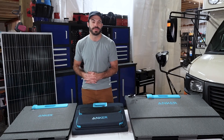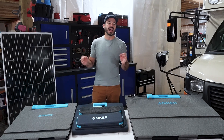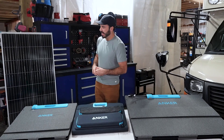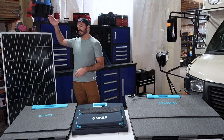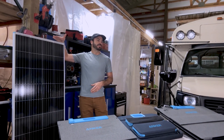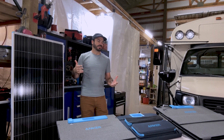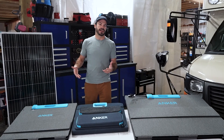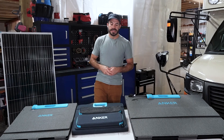The last step in picking out the right solar panel for your application is deciding the size of the panel you want to use, and that's usually measured in watts. Typically, if I'm installing rigid panels like this one, I try to find the largest panel that I can that will fit the available space. That's going to give me the most efficient use of that space and help keep costs down on the install.